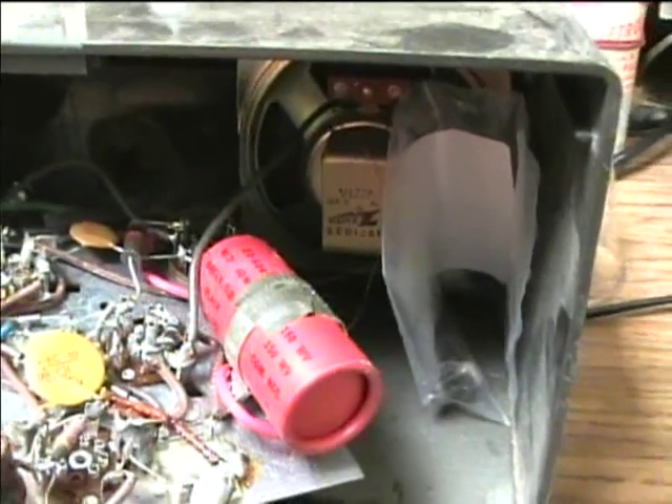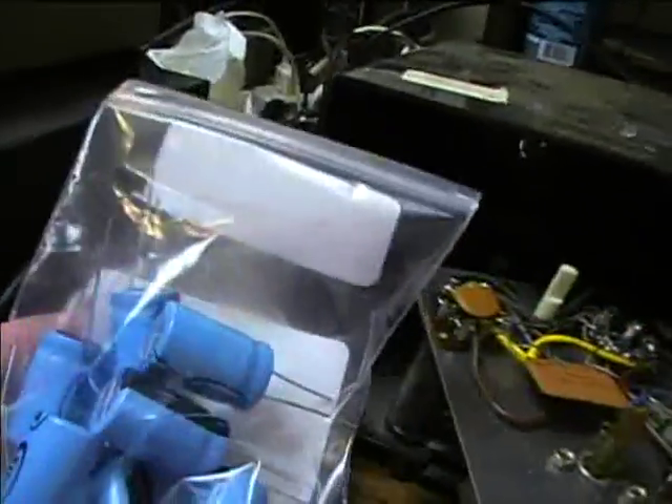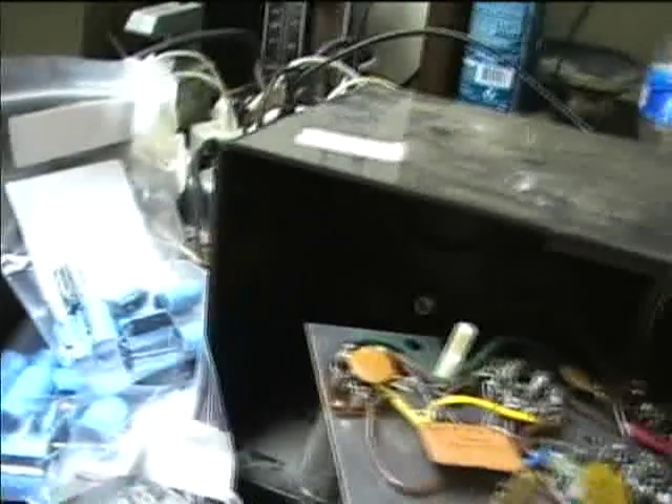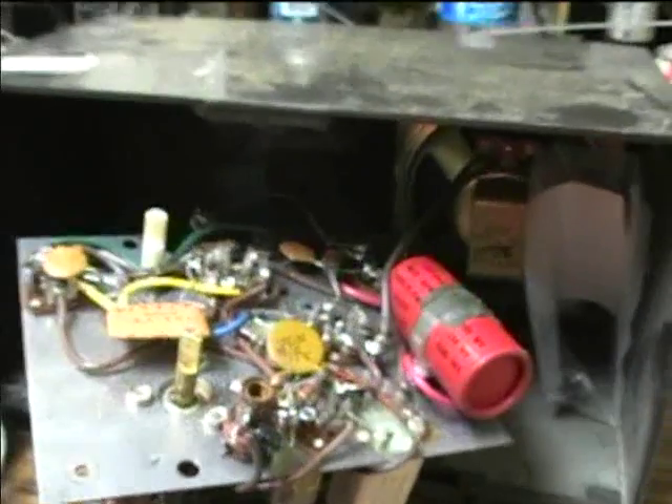What we're going to do is remove this old capacitor. I think what I can do is just cut the metal band on it, solder a terminal strip to the stub that was left in the metal band, and then hook up the wires to the new capacitors. We've got terminal strips and capacitors here as our supplies. We use a 100uF to replace the 60 and a 47 to replace the 20. Now they say you shouldn't go too high on the capacitance that connects right to the rectifier tube, because it can be hard on the tube causing too much of a surge when you turn the power on. So I'm going to get the cutters, cut the old band on the capacitor, and we'll solder on the terminal strip.